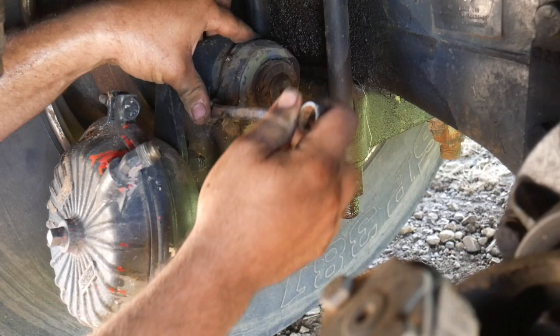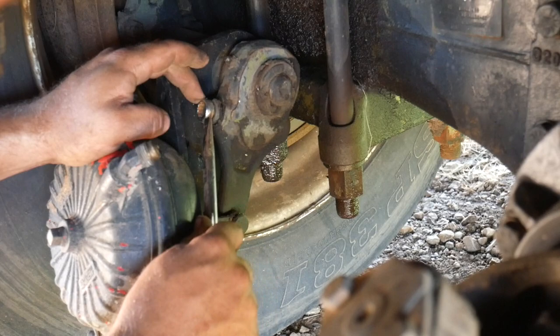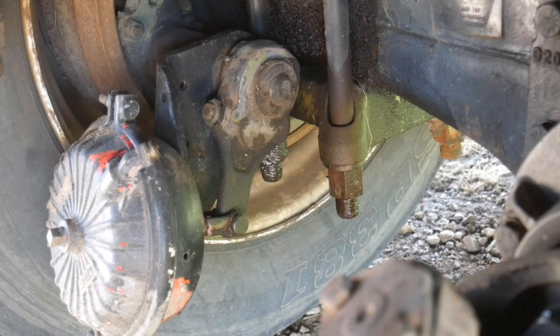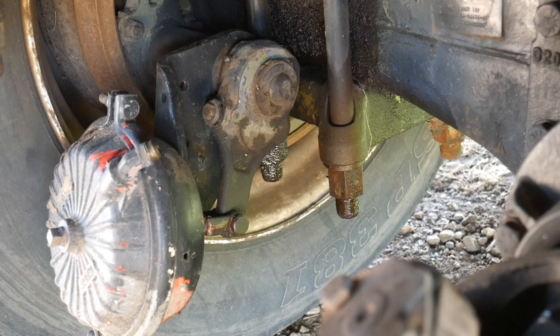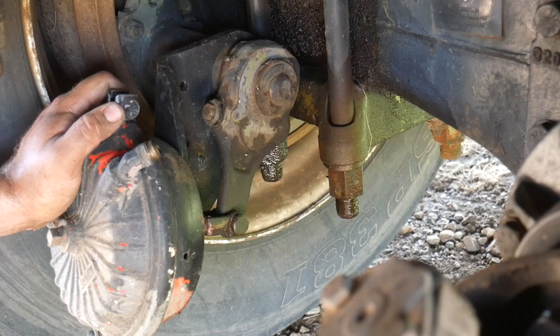When you get it where you want it, you can sort of wiggle your bolt back and forth, and this little spring-loaded sleeve, which is splined 9/16, pops out and locks this nut. And this will set the correct amount of free travel on your brake chambers. So we're gonna pull this off. I wanna talk about in a minute the difference why I'm changing these. Just bear with me, you'll get the terminology in a minute.